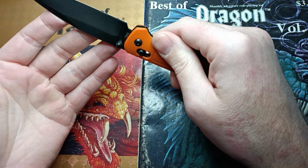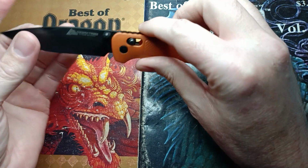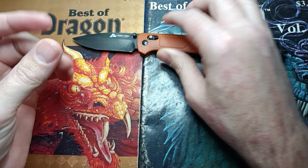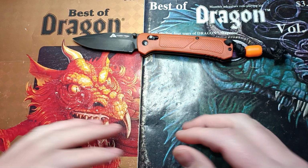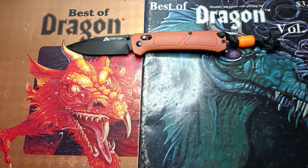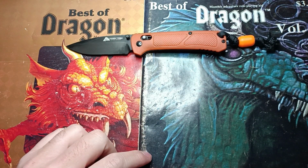That seems to be where the D2 is the happiest. Most D2s with a thin profile, in my experience, have been very happy at 17 degrees and stayed happy through a lot of cutting. That 17 degrees really added some extra time to those cuts. It seems to be what it likes.